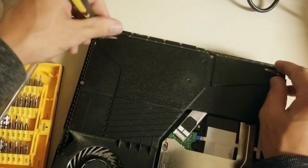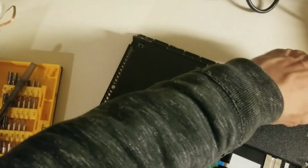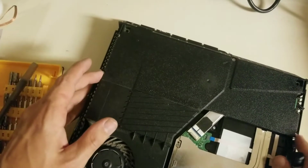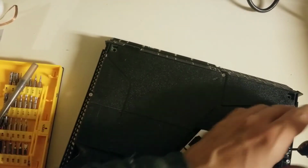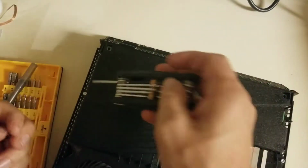And these are the two screws that definitely have to come out. So you can think about pulling up the motherboard, as I bump the camera mount. These ones technically don't have to come out to get the motherboard loose, but if you don't take them out, you can't get to the wires underneath, which means you're going to be pulling ribbon cables and everything else from the other side, which isn't the healthiest way to pull the ribbon cables. So basically just remove the power supply for, well, easy reassembly too.